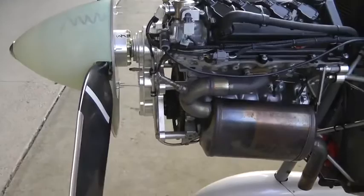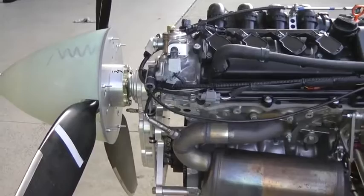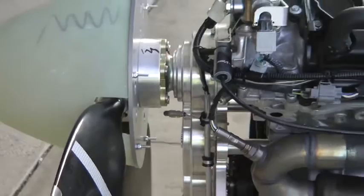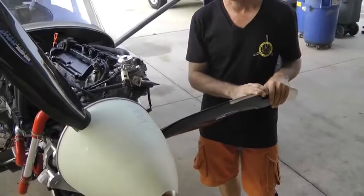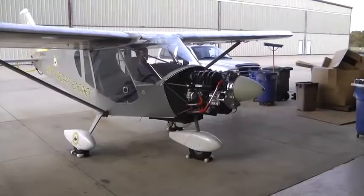After that, you want to prep your spinner bulkhead with some studs, or if you have screws around your spinner, you can use those as a temporary means to attach some washers. You're going to run the engine, measure the amount of imbalance, and then you can either use the instrument to calculate where and how much weight to put on. We're going to use a very basic solution — run the engine, put some weights on one of our studs, do it six times, find out which of the six studs makes the best improvement, and then increase or decrease weights until we get the best result.